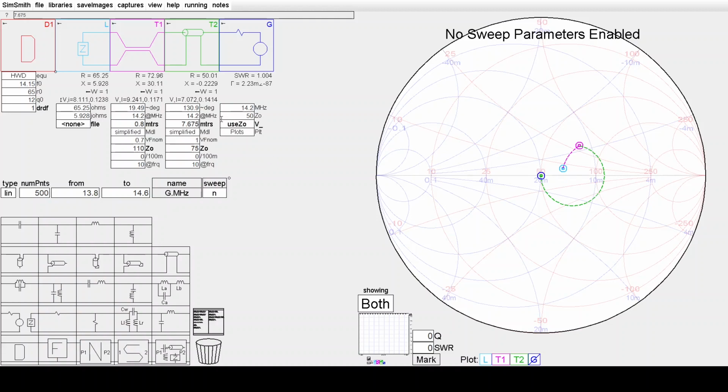Now in fact this length of cable has some loss, and it takes a little bit of tweaking to interactively get to this, but measuring the 1.5 to 1 from that input to that 9 metres, say, of cable, it gets you pretty close to then switching to 50 ohm indication, shortening the cable progressively until you get the cable that gives you a very low VSWR with reference to 50 ohms. There you go.